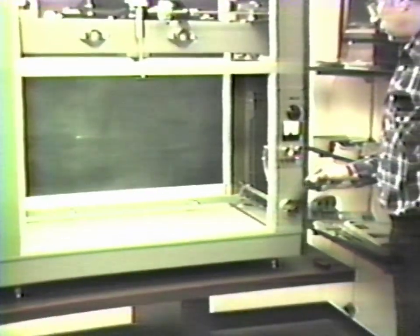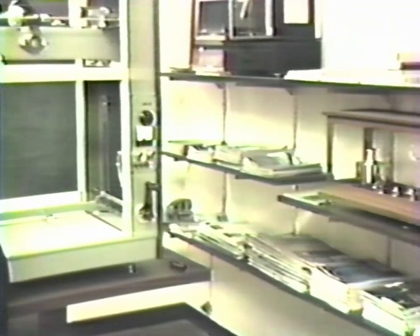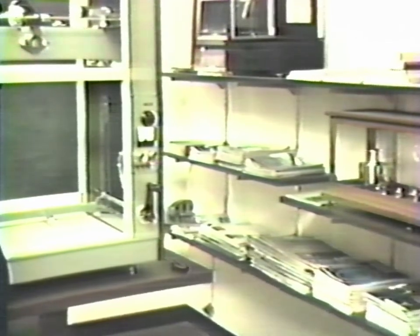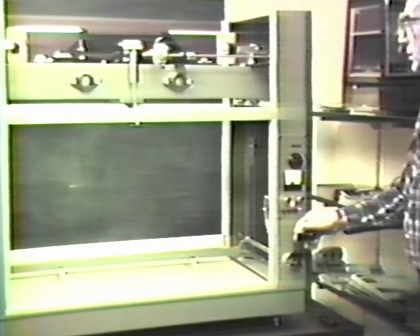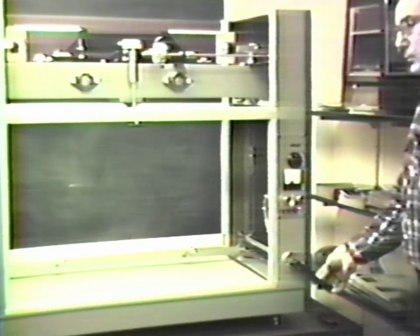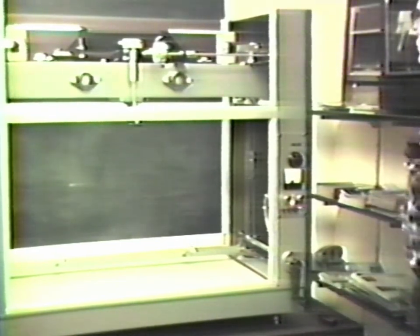Release the beam and gently rock the beam to the limits of its movement. Observe the pointer on the meter, making sure that it moves equally to both ends of the scale. Arrest the beam and remove the material which is holding the micro switch in place so that it can now operate normally.